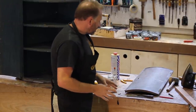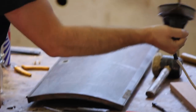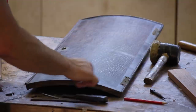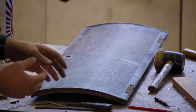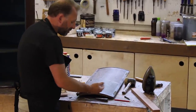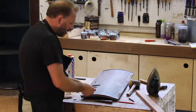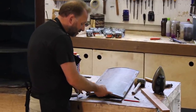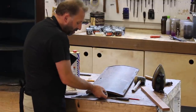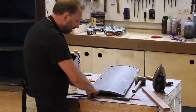So we've taken the door off. For the veneer, I've used the old iron here with some brown paper — brown paper is the best way. It's glued back down without using any additional glue. All it did was revive the old animal glue underneath using heat from the iron, and this will all wax away when we apply the wax later. I've taken the beading off — it literally just fell apart. Some of those hand-forged nails broke off; I've pushed those back in and sanded the face. Now we're ready to replace the bead.